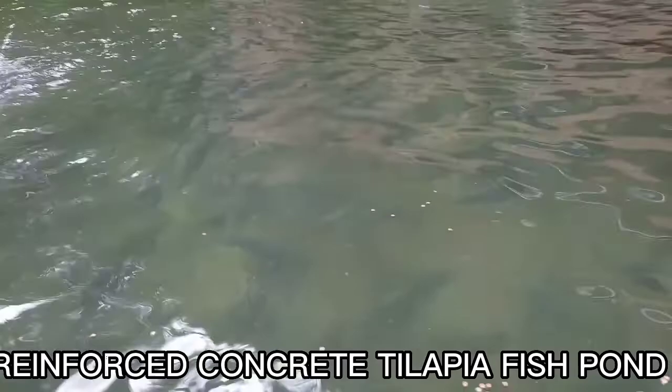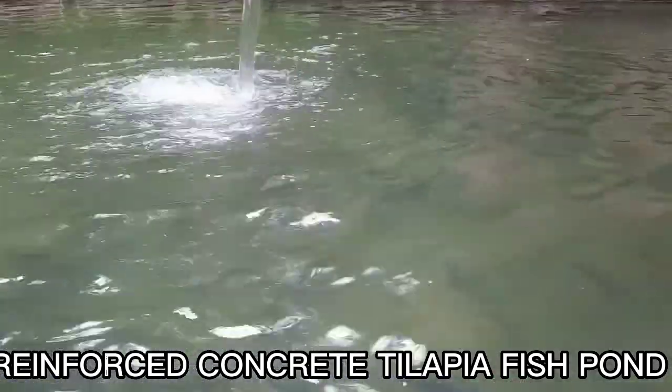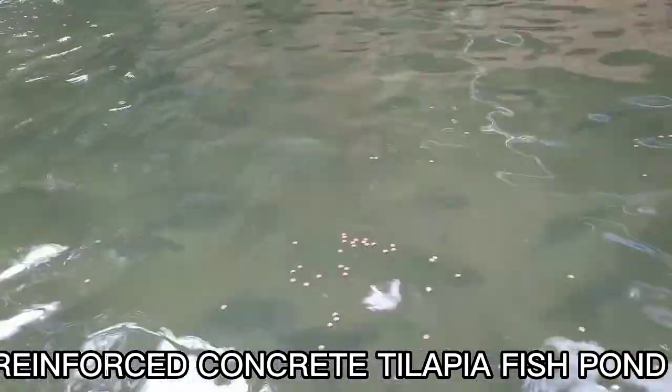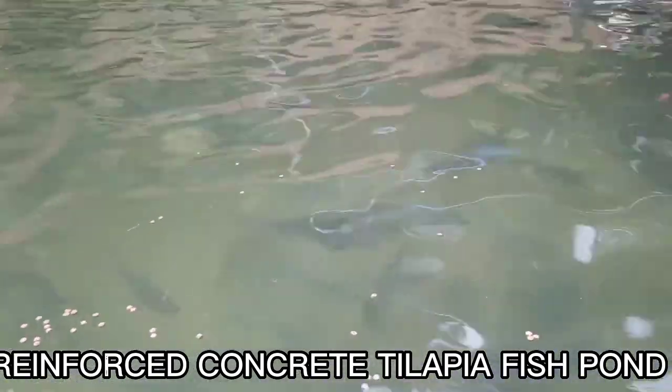Start with the bottom, then the sides, shelves, and lastly the top and any coping around the edge. Any junctions of pans poured in sections are critical as the site of future leaks and weakness to the shifting aspects of the soil.